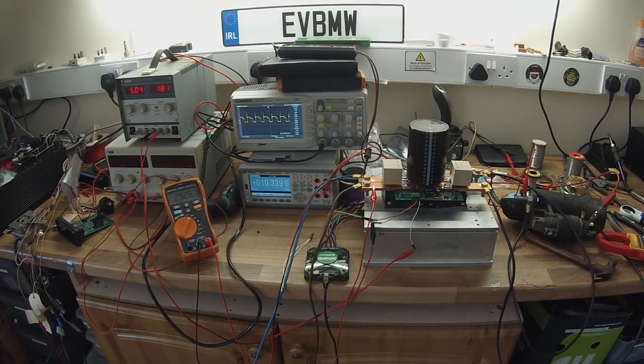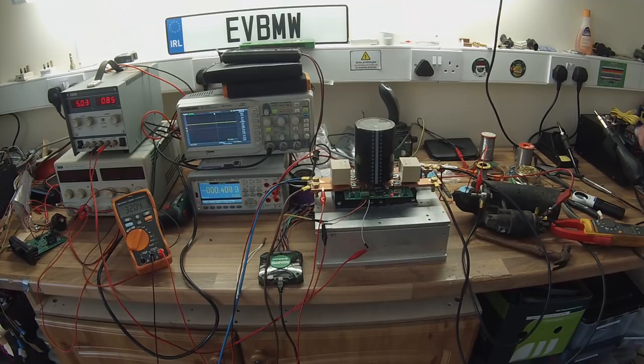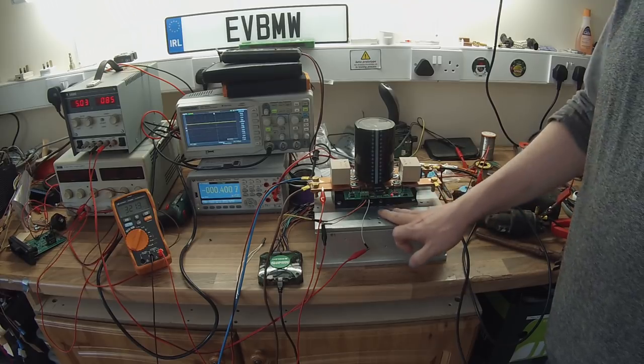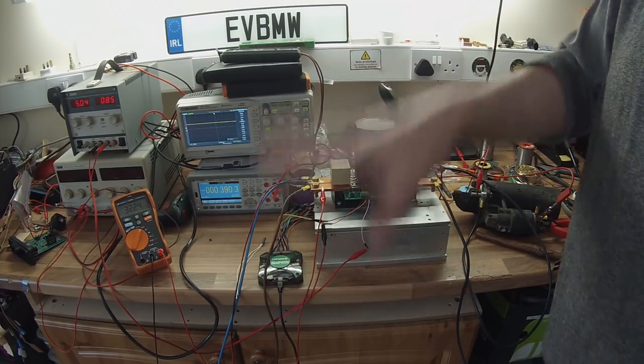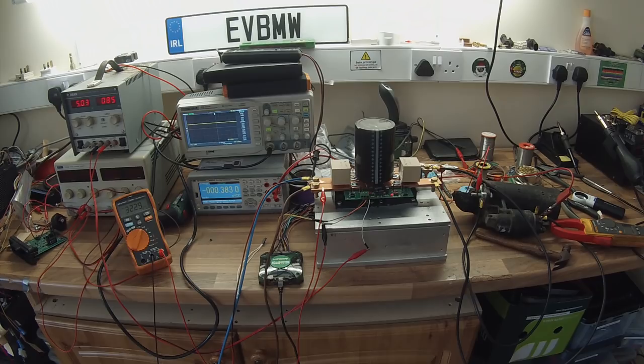All right, let's cut this off. Now, this is why we do low voltage testing when we're designing a DC motor controller, or in fact any power electronics device, because these effects show themselves up quite readily. So if we can identify them when we have safe levels of voltage and current and fix them, then it vastly reduces the chances of our blowing ourselves up, which is always beneficial, right?